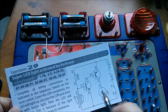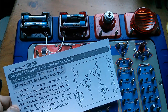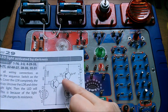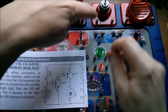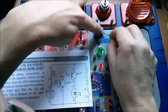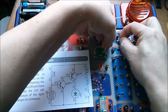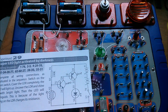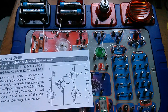I'd like to mark that as a PNP and that as an NPN — that would be useful. We've got NPN collector to PNP base, 28 to 30 — so NPN collector to PNP base, that goes in like that. And we've got PNP collector to the LED anode, 35 to 31.